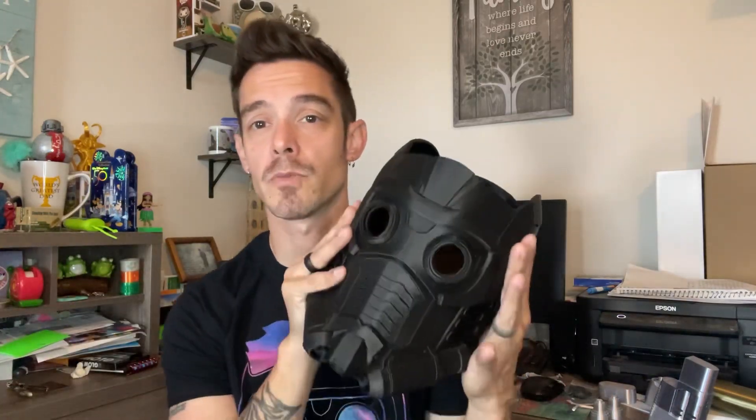On my machine I use primarily my Ender 5 Plus for the face and my Creality CR10 V2 for the back. On both machines I had my e-steps and flow rate calibrated. I have silicone bed mounts, upgraded extruder arms, and upgraded cooling fans. On the filament side I did a temp tower test, a retraction test, and the whole time these were printing the filament stayed in a filament dehydrator.